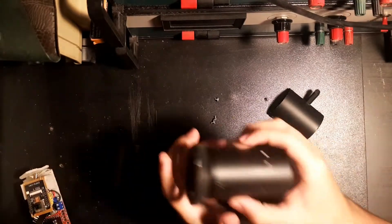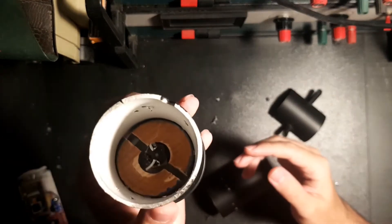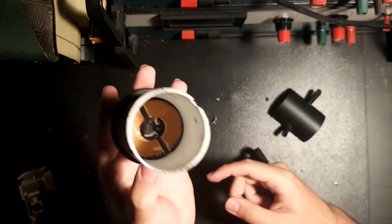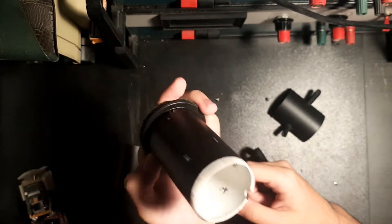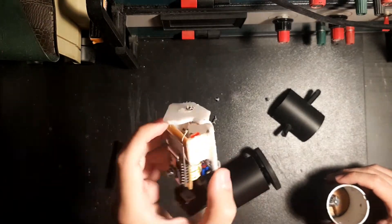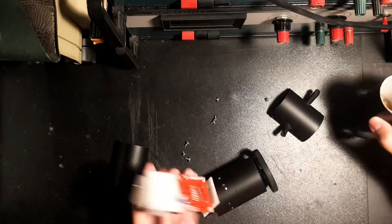Let's take a look at these parts first. These are all just the PVC pipe, the wheel, and inside here you might be able to see the motor. These are small micro-metal geared motors and they're pretty popular — quite small and actually pretty strong. They have a little DuPont connector stuck on the front, a two-pin DuPont, that then interfaces with two pins here. This just slots in and gets attached to the motor so you can just remove these and work on them.